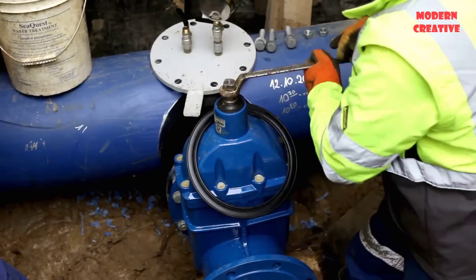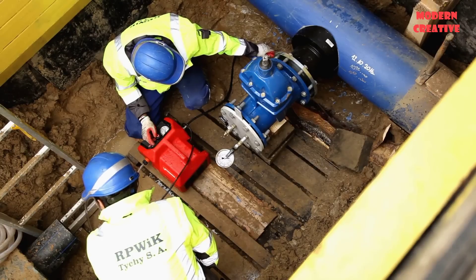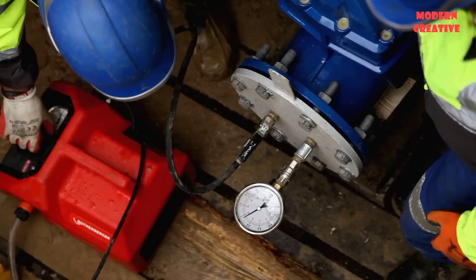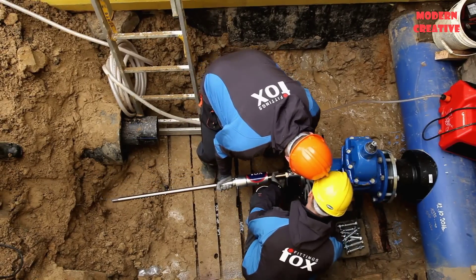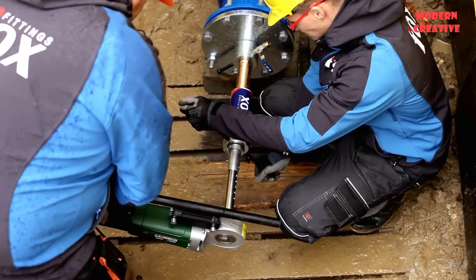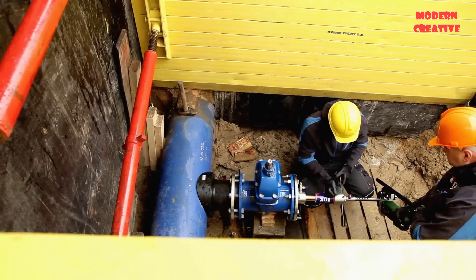Tap completed, coupon or cut portion retained by latches on pilot drill. Pressure is contained within the hot tapping machine. Cutter and coupon retracted and valve closed.